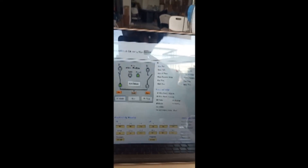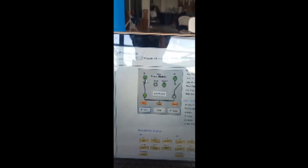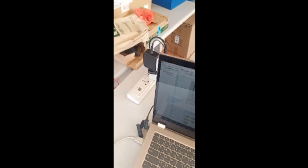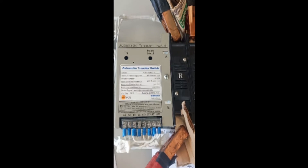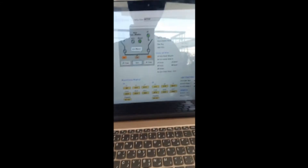Going to monitor and conducting a test transfer. Currently both sources QS1 and QS2 — normal and emergency — are live, using an MTS 3-phase connected to the ATS. Now let us try manual: open first. We can see on the display that the ATS shows 'open' — it means trip, it is off.